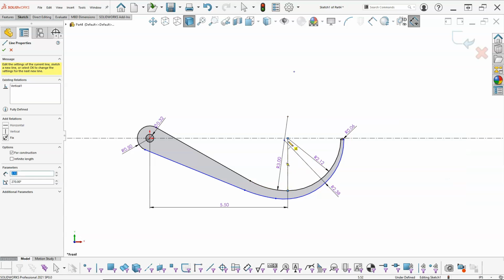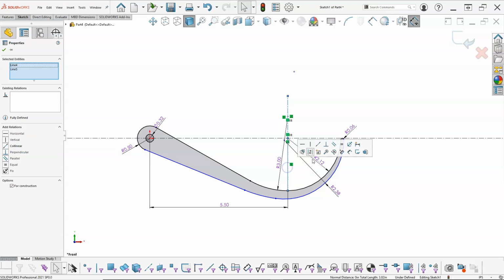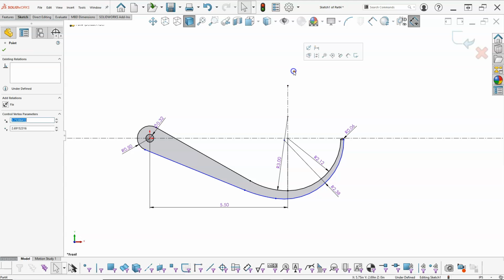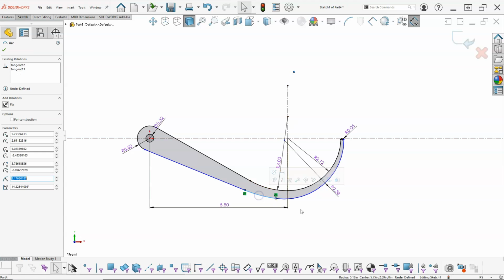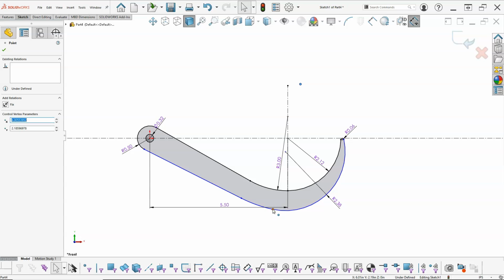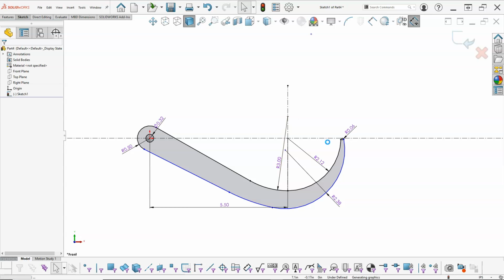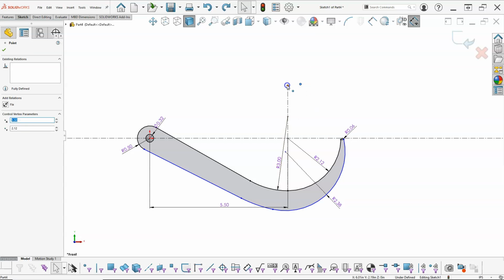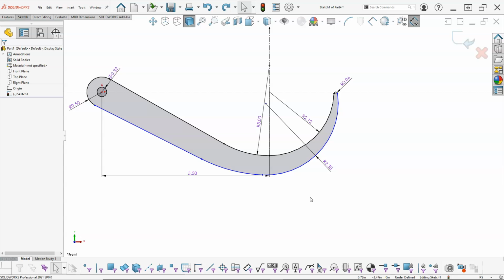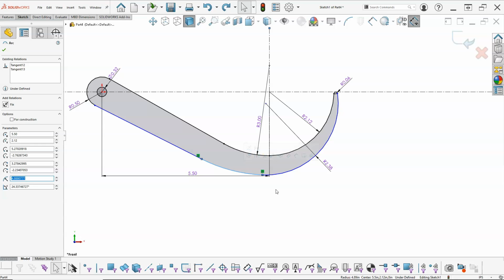So if I go from there to there, and from there up a little ways, make those two center lines equal, that will give me a location for that center point. And so if I highlight that, notice it pops up. And we're going to have some things move around, so that'll be interesting. I'm going to Control Z since I lost my point. And we'll go ahead and make those coincident. Well, that came in a little bit cleaner than I expected it to. And then where are our tangencies? Oh, we got tangents.